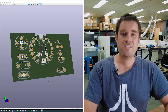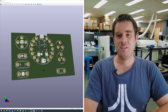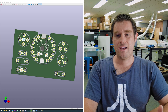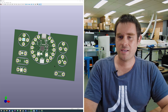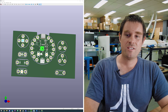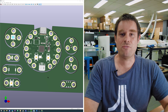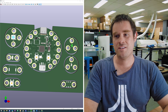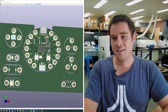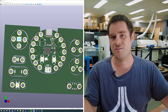In a sneak peek at an upcoming project, I've been working on an e-textiles development board. On this board is a familiar snappable prototype layout that you might have seen in other e-textiles projects. This one's going to be RP2040 based so you can do all of your development in MicroPython, and it's going to have a range of peripherals: a temperature sensor, a light sensor, a switch, an RGB LED, a single LED, a buzzer, and so forth.